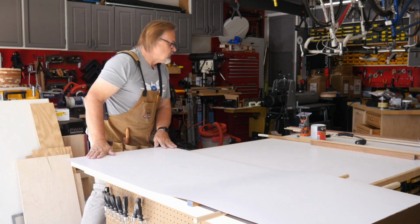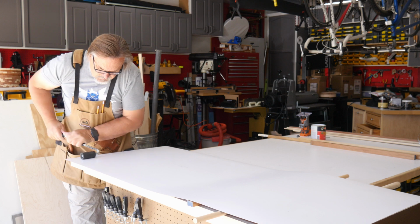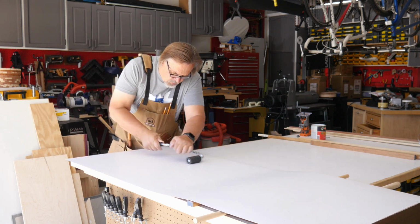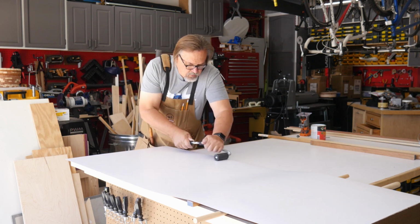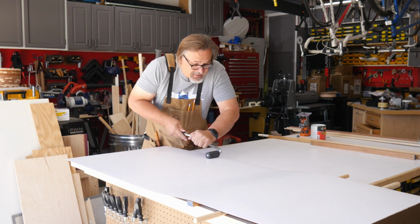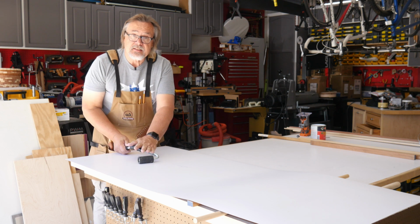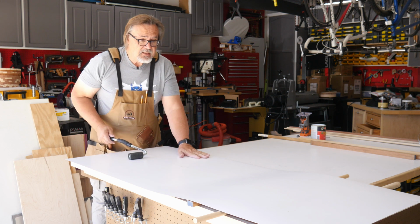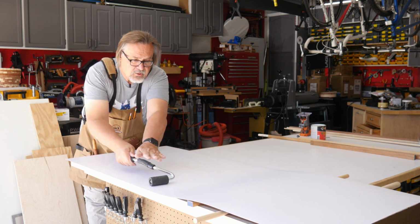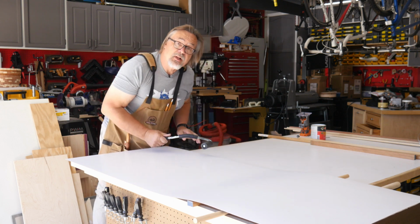Now before I continue on over there, I'm gonna press this down with a little bit of pressure, just to make sure I get a good bond on it, and make sure I get all the air out. What are you using? Well, I've already explained to him that this was a J roller, but yes, that's a good question in case anybody's forgot this. So this is a J roller, and again, you can use any kind of rolling pin that you want, anything that allows you to put some pressure down on it. You can even sit down on top of it and run your butt back and forth if you want. Whatever puts pressure on it, that's what you need.